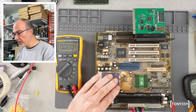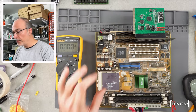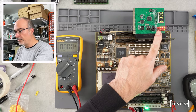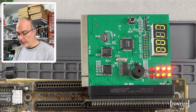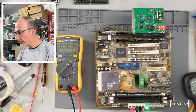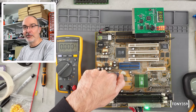There's no battery, but let's give it a quick go. There's not much happening. Let's plug a beeper and see if the board is telling us something. It went a bit further than before — we got C6C1 but there's no beeper, assuming I'm in the right place. CPU is getting warm. The reset line is working, but sometimes it stops at C100, sometimes it goes a bit further. Let's try resetting the board while it's running. It's working now — we need a video card again. I didn't do anything, just turned it off and on again while I was looking for a screwdriver.